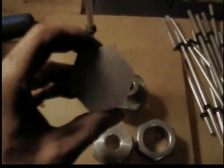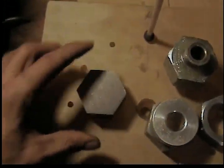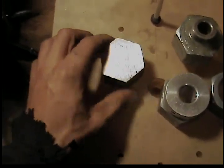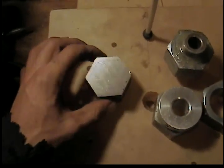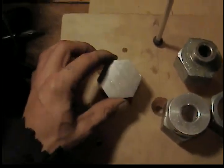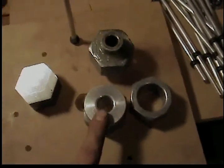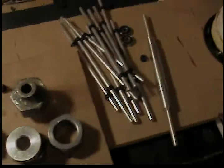Maybe a little variance but nothing really visible to the eye or the angle gauge. So what we had to do is take this one and three quarter inch hexagonal mild steel, punch a hole, bore it out again so that it was somewhat like the hitch nut, make another bushing, punch it in, and then we'd stick the magnets to it and cast it.